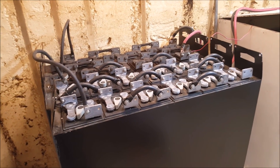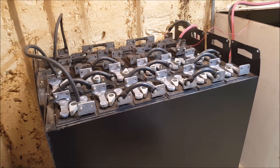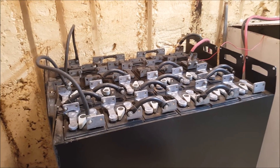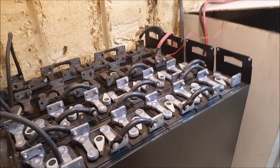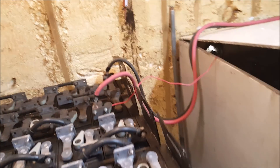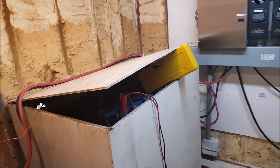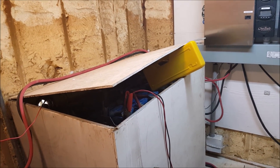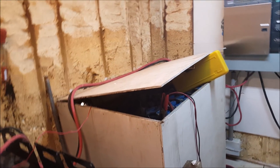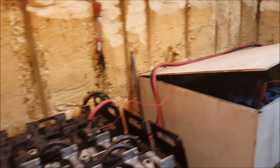We've added two new sets of batteries. This right here is 48 volts, 1,500 amp-hours. These are not genuine forklift batteries but they're very much like them — built by the same people, just with standard connectors. We just got this outside set in and I don't have cables hooked up to it yet, so I'm running off the one in the back and one set in this box. One set inside the box is a little bit out of sync with the other, so we've got a charger hooked up. During the day when we have power we're charging it up trying to get it in sync. We might even try hooking all four in parallel at some point and have 3,000 amp-hours, and we'll see if 13 kilowatts will charge it. If it won't, 1,500 amp-hours gets us through a day or two anyway.